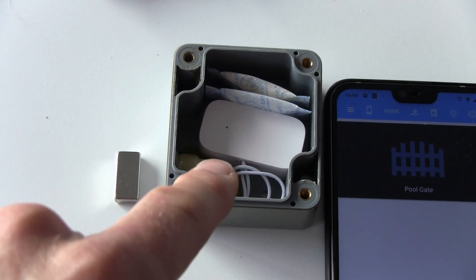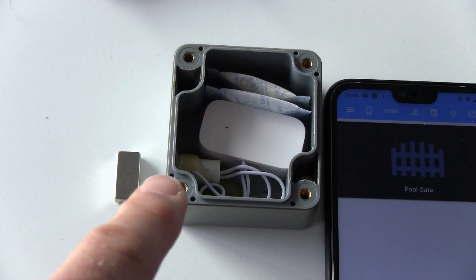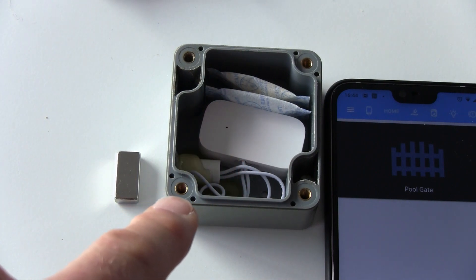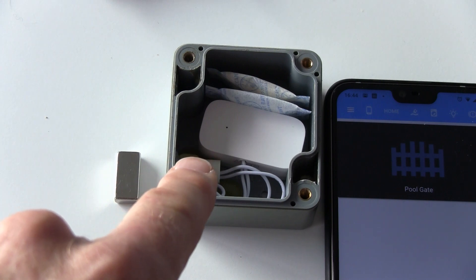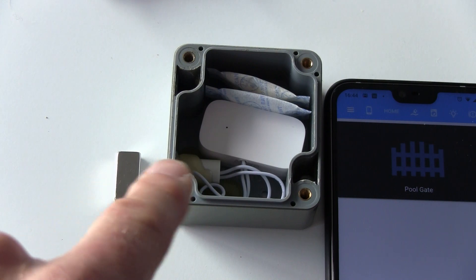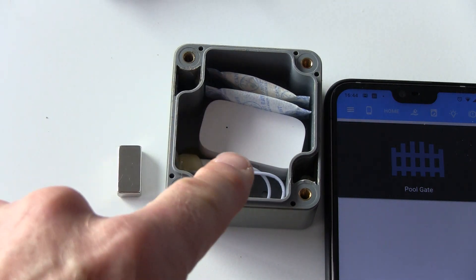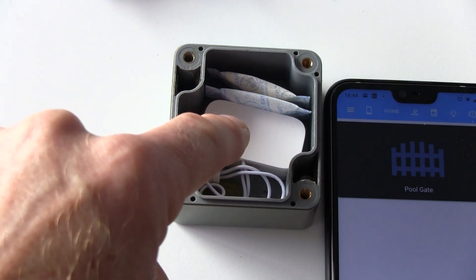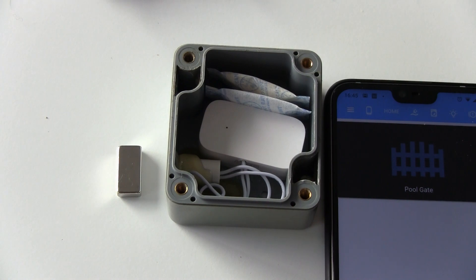The furthest sensor on my property uses a Dresden USB Zigbee key, which is in my garage connected to an Intel NUC. That furthest gate sensor is probably 50 meters — around 150 feet — from the Zigbee USB key. I do have a Xiaomi mains-powered Zigbee switch behind the TV cabinet which acts as a router. So there you have it: outdoor sensors in an IP65 case, a cheap door reed switch wired in parallel to the existing reed, and a neodymium magnet — giving you a wireless IP65-rated outdoor sensor. Thanks for watching.